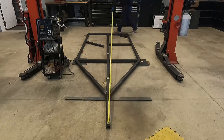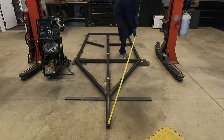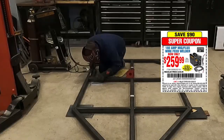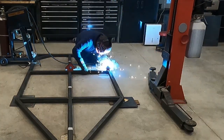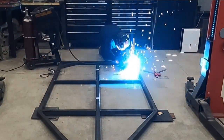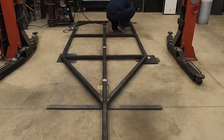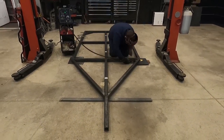I would take breaks every now and then and just re-measure. I'd use that nail trick to make sure everything stayed square, even though I'm adding heat with the welder. The welder itself is nothing fancy — I had a coupon from Harbor Freight, so that's what I got. It's the cheapest welder they had that uses 240 volts. Some of the accessories I got were a welding cart from Harbor Freight, a little gas flow meter, and the gas I get from a local hardware store with an exchange program. I've never used a high-end welder, so I wouldn't know the difference. In the meantime, I'm enjoying using this one. Here I am putting tacks all around the trailer, making sure not to put too much heat into one spot.